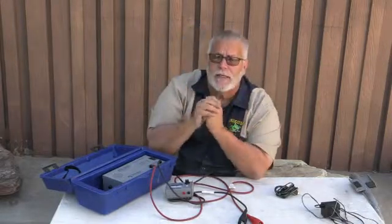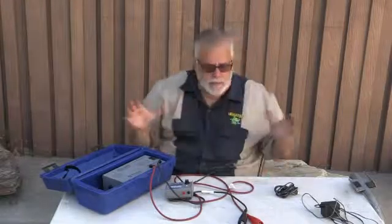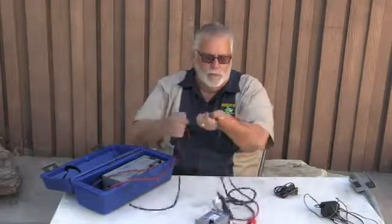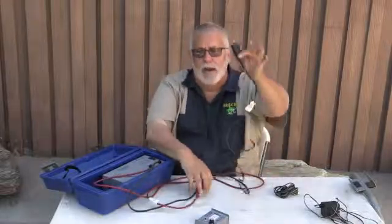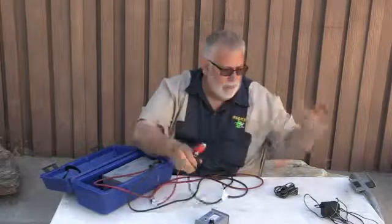It seems like a lot of mess and work, but if you're water managing and trying to keep your controllers working and use all the new water management features in the field, you want to make sure your clocks aren't all running on battery-operated units. This unit helps you with that. Normally you go out and wire track with any kind of tracking equipment, like a 521 or the 800, and then this unit pinpoints you right on top of it. You put the black to the ground, red to the lead out in the field, on the wire you're trying to track, and then you pulse it.